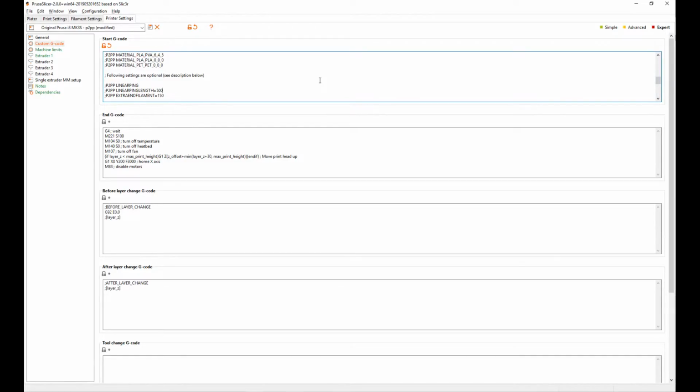If that is the case, you might want to increase this number as much as possible without it affecting the calibration. So you need to find a sweet spot between it struggling to keep in calibration, and on the other side having too many stalls during the print, which might affect your print quality. They recommend not going below 300, but there is actually a bug in P2PP right now. If you go below 350, you will get an error message, because they are checking that you are not trying to go below 300 according to the documentation. If it's 350 or below, it will give you a warning and actually use 300. That's a bit messed up, but 500 should work fine.